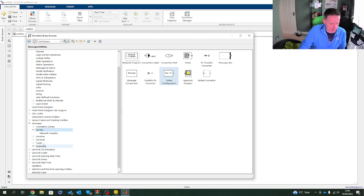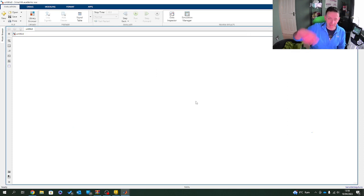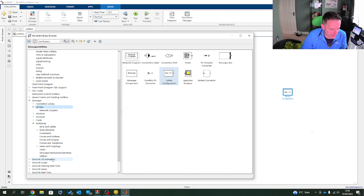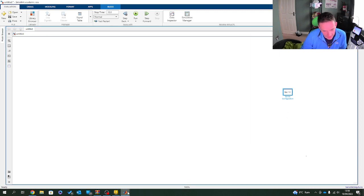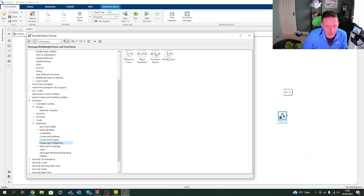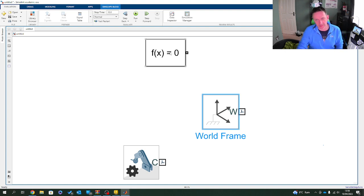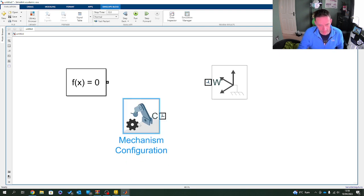And again, anybody who's sat in my classroom will well know this, because you've had to listen to this again and again. Same process, time and time again. I come back and go to utilities on my multibody and go to mechanism configuration. And then finally, I'll go to frames and transforms and bring in a world frame. This allows me to set up my datum, my world, my centerpiece. So first things first, spin that round and then spin that round.